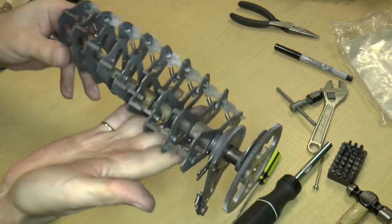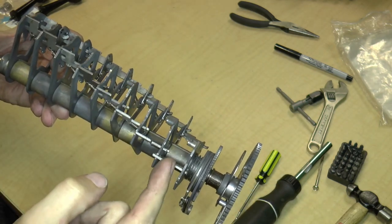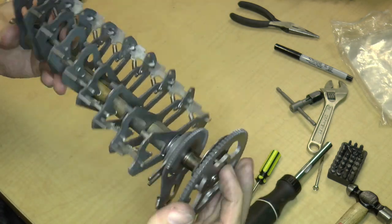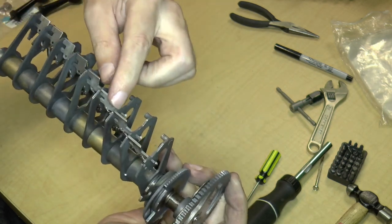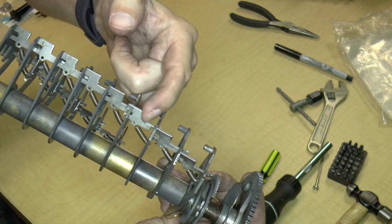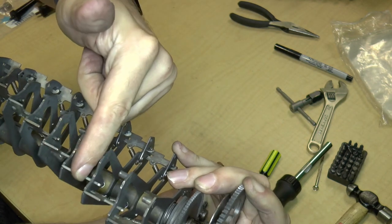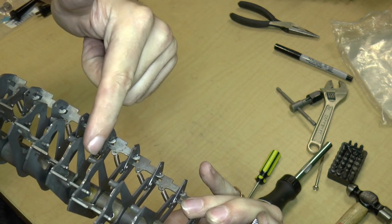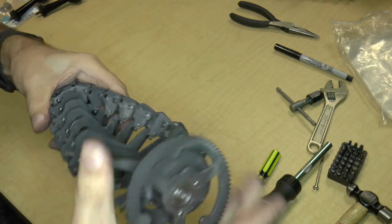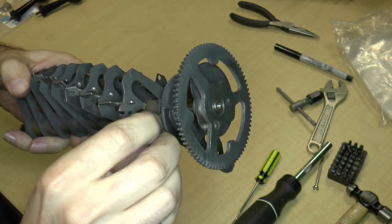This is the carry axle. It's got — I don't know why they call them dogs, but these are called dogs, and they're spring-loaded. The idea, as we went over before, is that as this thing turns, if a carry is needed, there's a lever that pushes this carry dog in, and as it rotates it will turn the digit gear one. Then this thing will reset that lever so that as it keeps turning, the carry is no longer set. These are fixed gears here at the end. I'm not sure what this is for, and this seems to be spring-loaded as well.